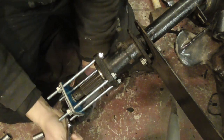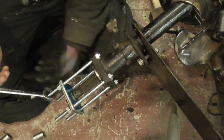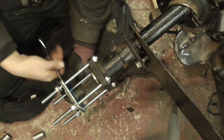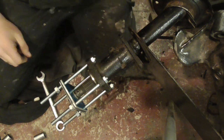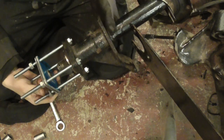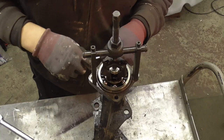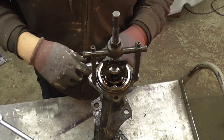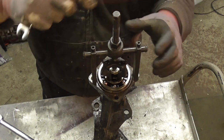Tightening the opposite side as well. It'll pull off now — and yes, sorted! Once you've got your tube off and you want to get your bearing out, it's good to turn it over and put a bit of bar down on the top and tap it out from the inside edge. But if you've got a basic puller, they're only about less than ten pounds on eBay, and they're really simple to use.